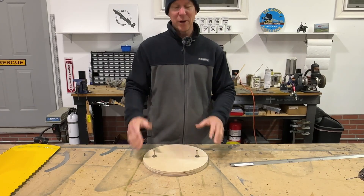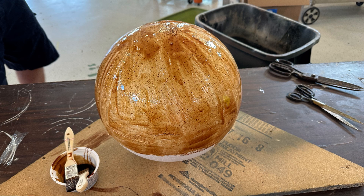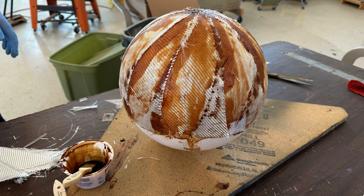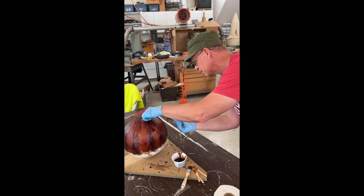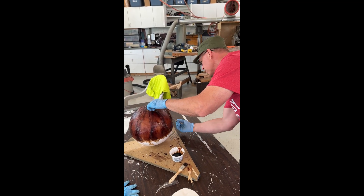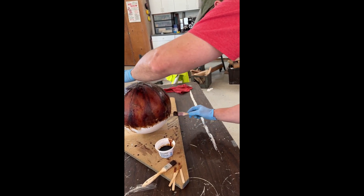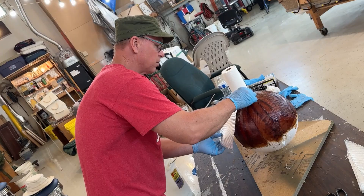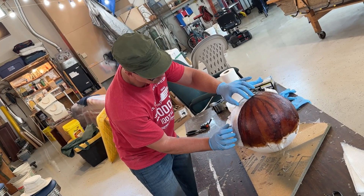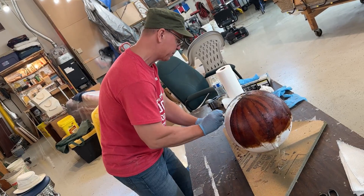That foam ball on the wood was going to be the mold to build the dome. The very first step is to take resin on a brush and cover the ball. Once it's covered with resin, we start adding the fiberglass. I cut a whole bunch of pieces in a triangle — basically the shape of a piece of pizza — and that's what I used to wrap around the ball. Len filmed this on his phone. There are three layers of fiberglass total, adding a little more resin between each layer, and the pizza-shaped pieces conform really nicely to the ball's shape.